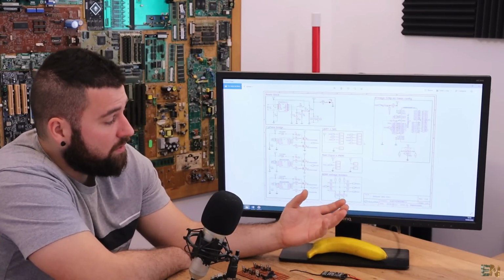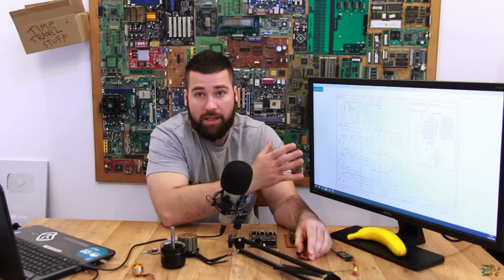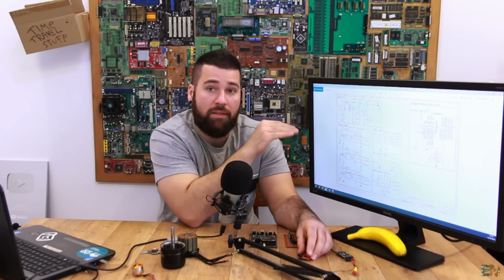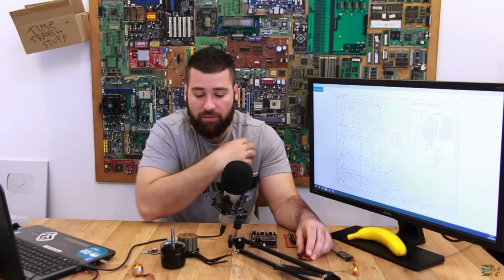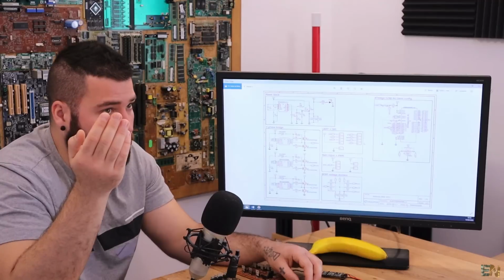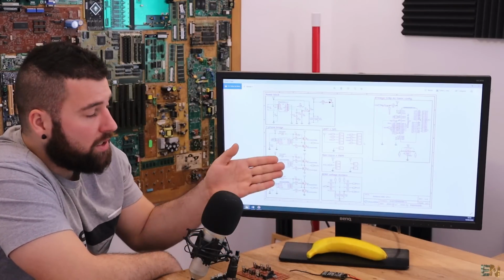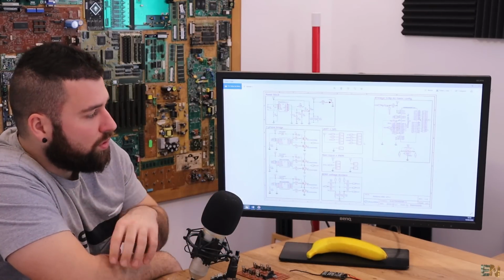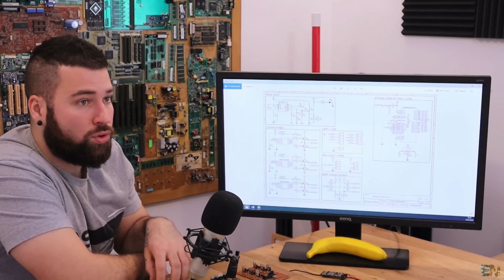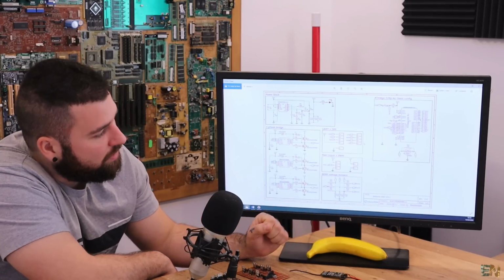And these are the dividers that are coming from the back EMF. And why do we need these dividers? Well, that's because the voltage value of the microcontroller is a maximum of 5 volts. But the back EMF that we get from the motor, since we are supplying this motor with maybe 20 volts, could be above 20 volts. So that voltage will burn our ADC or the comparator of the microcontroller. So in order to connect the voltage from the motors, which is very high, to the microcontroller, which is very low, we need to lower the voltage, and that's why we use these voltage dividers.